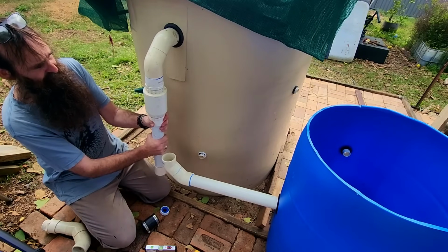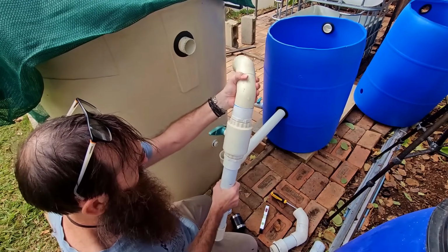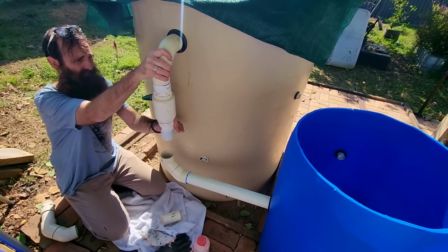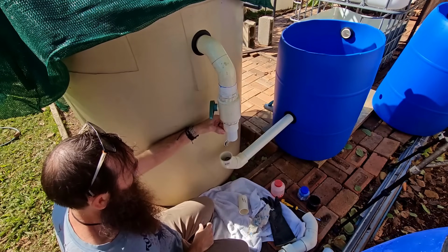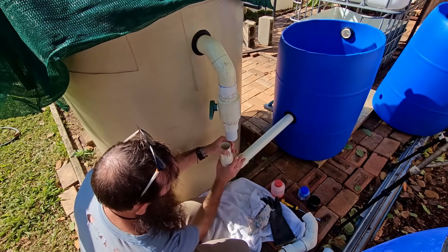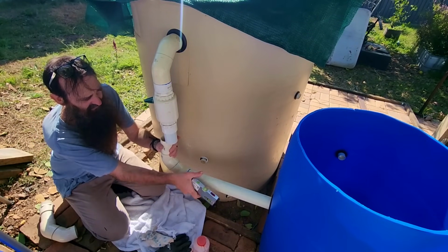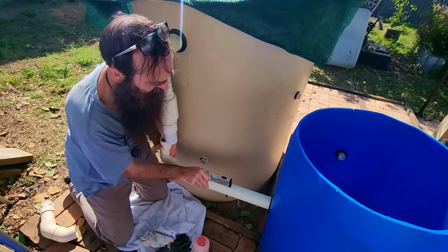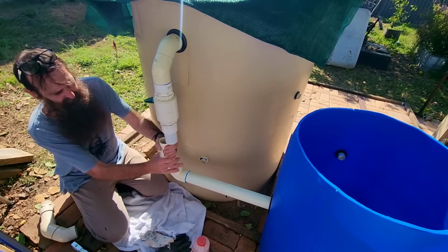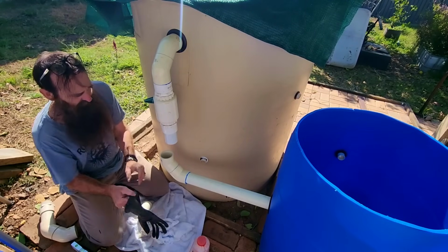So I will take this up to the saw under the house. Actually, I can take the whole thing up and chop it off. So there we go. Nice shorter pipe. And now all we need to do, I think this is right, I've basically measured in 30 mils and the difference and everything. And I think we put the level up the right way. Yeah, when those two are touching like that, we're pretty much well level. So I know that this pipe will go in a little bit further when we glue it. So there's no drama there.